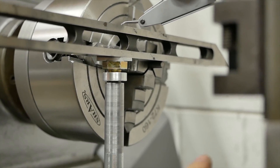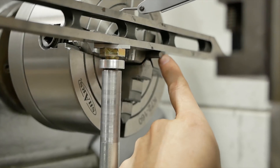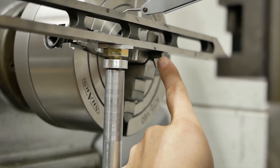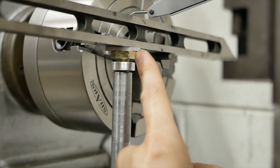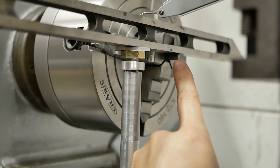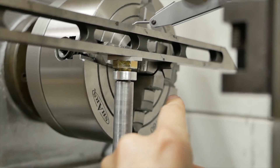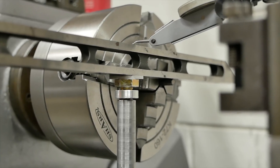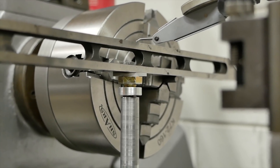Here's Ryan's crazy setup for getting exactly center. We've got a quarter inch end mill, a dial indicator on a four jaw to be centered, an eighth inch gauge block, and a straight edge. So this puts this guy right in the middle of this end mill. And then you just indicate across this straight edge, and it should be exactly in the center. If you guys know a better way, comment below.